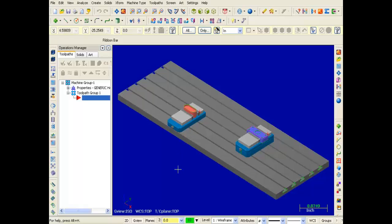Hello and welcome. In this video I'm going to machine these two different parts located in the two machine vices with the same CNC code file. What I'll be setting up is a different work offset for each part. I'll be creating two different toolpaths and include the offset number in each toolpath. Each toolpath is going to be placed on an offset number instead of a coordinate position. The CNC operator can run these parts without concern of how the fixtures are positioned on the table. All the operator needs to do is touch off the two parts correctly before running the machine and input each offset position in the CNC control.